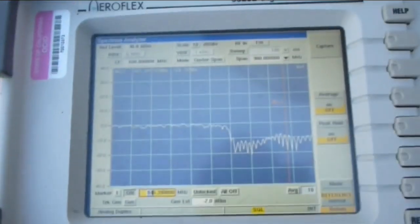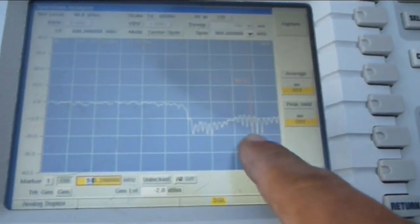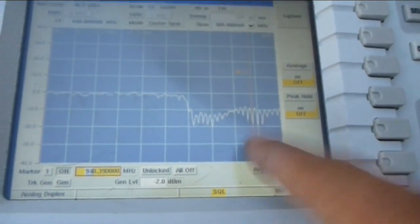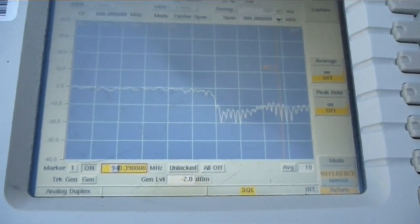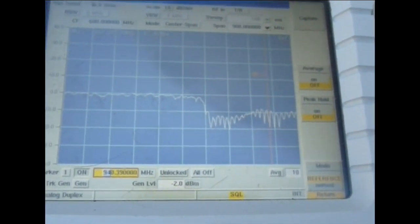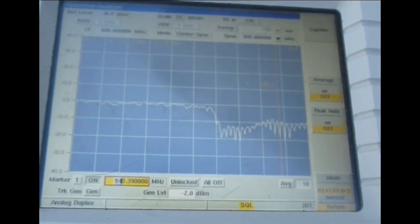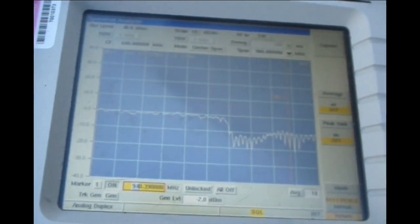Here's the 800 MHz range — going from 700 around there up to 940, right in this line here, and I'm getting minus 16. It's covering that whole span — that is freaking kick-ass. So my little theory here is going to work out really well. This setup ideally is for a command post or buildings, but I brought it inside the vehicle so I can have the same capability. I could cram three more radios in there using one antenna port, leaving me with other ports to work with.